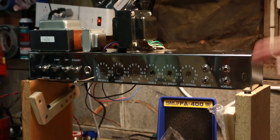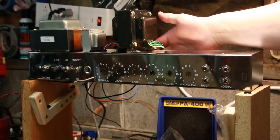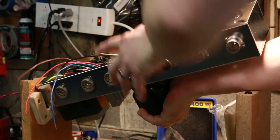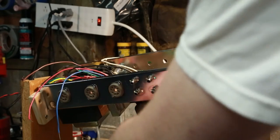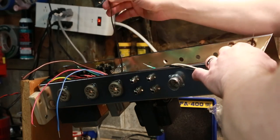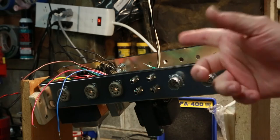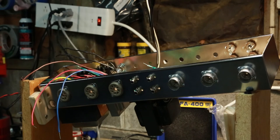I'll flip this over and give you a shot from the inside. I've put in my input jacks, the switches, the fuse, and so on. I've got my tube sockets on the back. There's my output transformer, and here are the black wires on my choke. The reason both wires are black is that a choke doesn't care about orientation — its job as an inductor is to slow the change in direction of the AC current, which helps keep ripple down and under control. The choke helps with filtering as well.